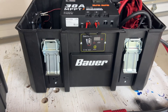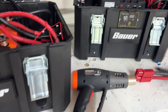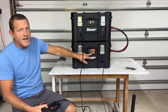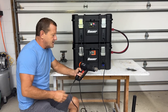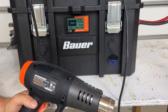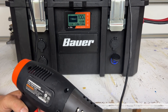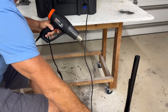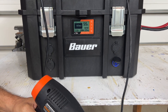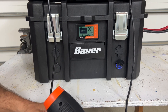Here is our alternating current module — we have our inverter down in the bottom. We're going to hook this thing up and test it out to make sure everything's working. This is 1500 watts, should be 125 amps pulling through those batteries. We're seeing 126 amps right now. Now we're going to turn on a little vacuum cleaner, which is going to draw a lot more amps — and right now we're going 200 amps between the two batteries. That BMS definitely holds that 100 amp capacity.